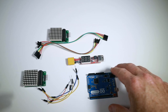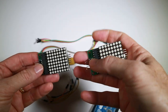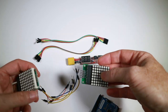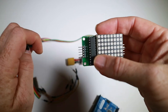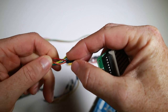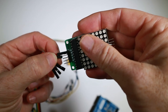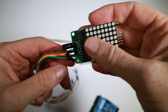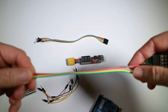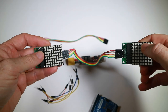Here are all the bits and pieces we need. I'm going to start by connecting one matrix to the other. This side is the input — it goes to the board — and then there's an output which goes to the next one; you can keep chaining them together. The only thing I'd say is that the top pin is VCC and the next one is ground. You want to be sure not to mix those up, because that's where things will explode if you reverse the polarity. So I'm using the red wire for VCC and the brown wire for ground, then the remaining ones at random. Follow the colours through so it's exactly the same coming into the input of the second matrix.